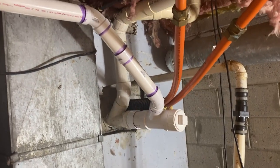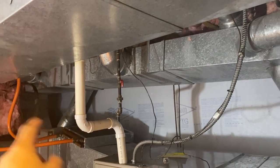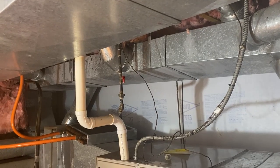Alright, we are all connected. So we go all the way back here, all the way around and through the wall in the back corner, into the living room ceiling, and up to the kitchen sink. And now I suppose it's time to test it and run a bunch of water and make sure that nothing leaks, make sure that the slope is good and everything. I'll be able to listen to the water.